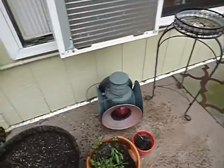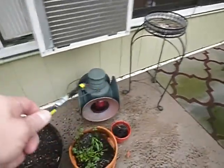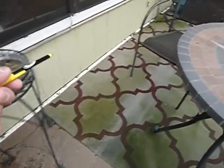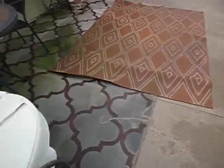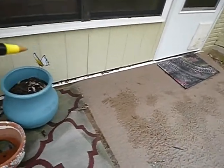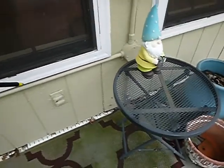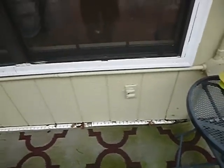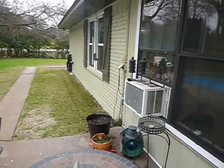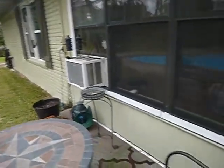There's a drain right here, so all the water comes down to the edge of this siding and rolls toward it. It gets a little higher further along so you get better performance there, but right in this low area, not so much. This receptacle outlet is not GFCI protected and does not have an in-use bubble cover. The other one shouldn't be operable at all — it should be a closed-face cover.